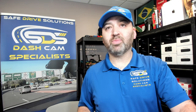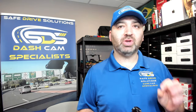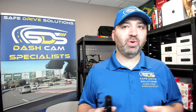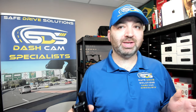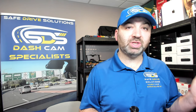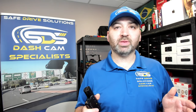So the A139 Pro uses a front STARVIS 2 sensor, which is 8 megapixel, and it's the newest IMX678 image sensor. Viofo is the first to deploy the newest Sony STARVIS 2 tech. The A139 Pro is powerful enough to outbeat most 4K dash cam competitors with immensely upgraded image clarity and accuracy in license capturing. The latest STARVIS 2 IMX678 sensor offers a wider dynamic range in a single exposure than the normal STARVIS sensor that, if you do have a prior dash camera, you would be familiar with. It'll bring much less noise and motion blur during day and night.